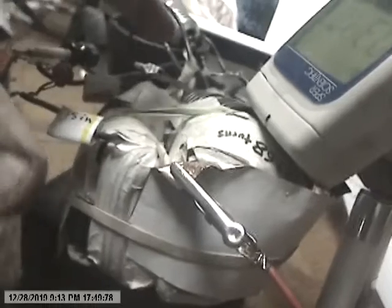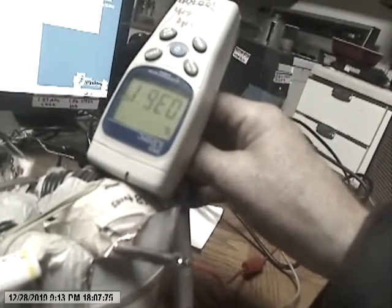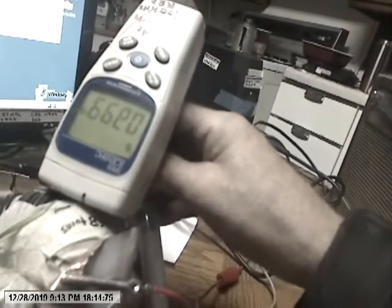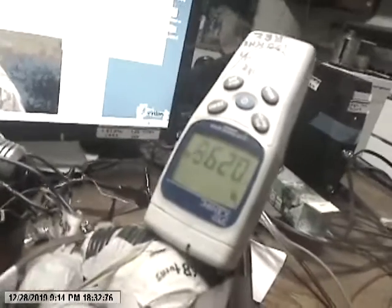I've got a capacitor across the 50-turn coil. There's a 50-turn underneath this 15. I tried for 150 turns but got 75 and 68 out of it. This probe has to be at a certain spot to really detect all that's coming out — you can move it over, it can be adjusted. Got mine on the stand, raised up. That's my setup. I eliminated the inductor on the input because I got more output without it.